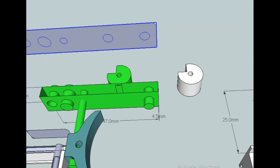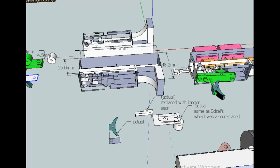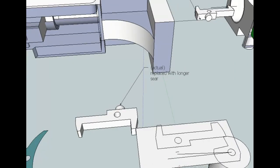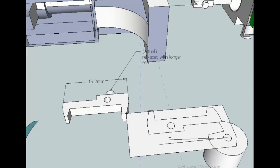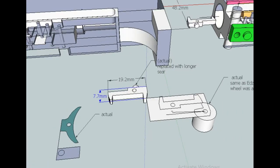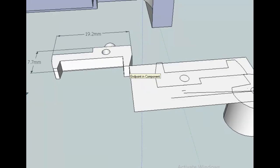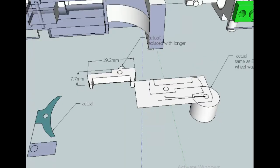The wheel is bolted through this side, the underside - you'll understand better when I show you. Here's the sear. It's about 19.2mm - it's kind of small but it works. It's 7mm and the hole is two millimeter diameter. The reason is it's easy to get pins that are two millimeter in diameter. I actually use stainless steel welding rods - if you remove the flux on the outside you can clean the rod off and cut several pieces to your needed length.